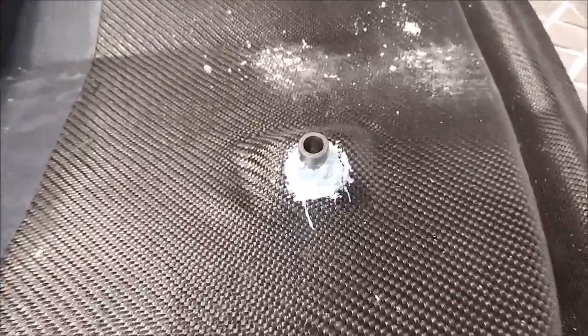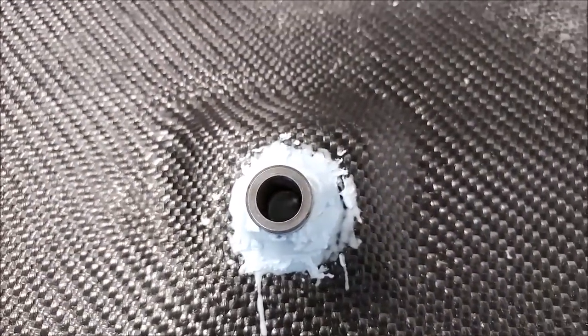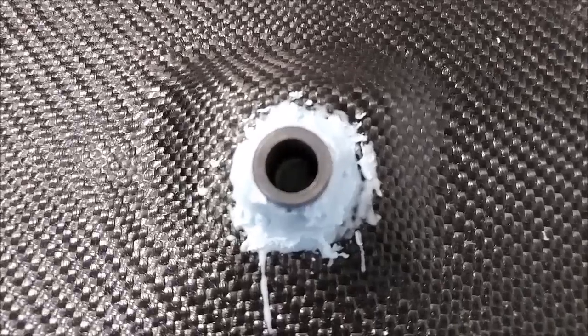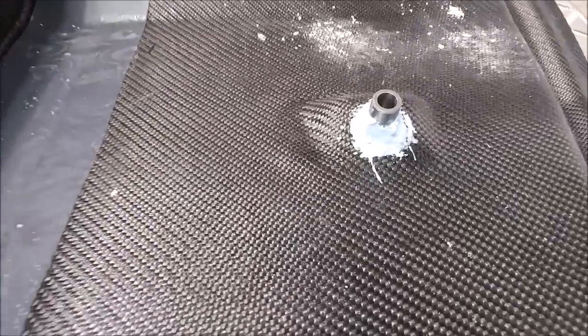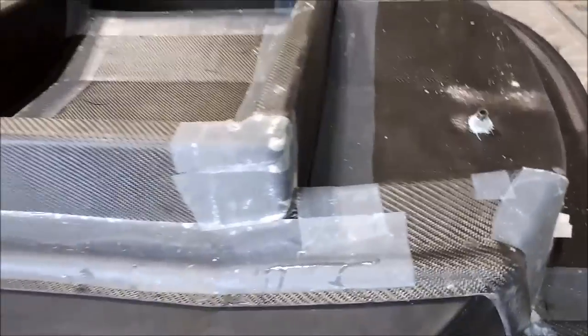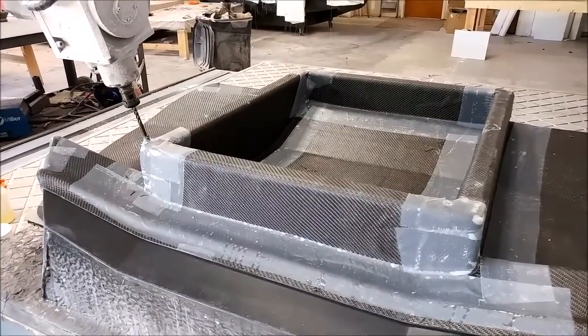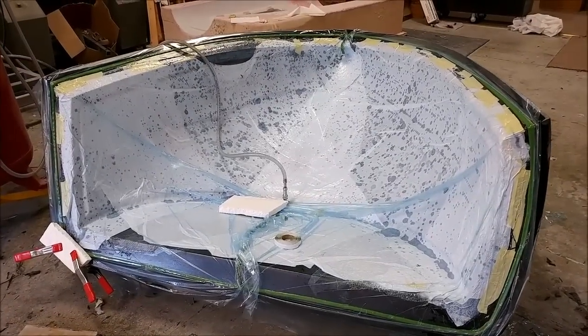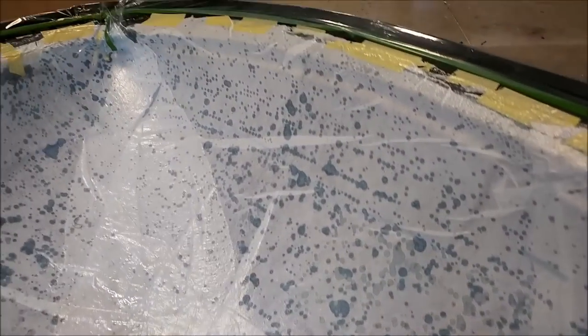While that was going on, I was bonding in drill bushings for the mold for the rear pressure bulkhead. These are for the gear pivot point and also for the upper gear scissor rotational point — four altogether, all half-inch. You may have noticed I had the drill bit in upside down; the reason is that the bushing doesn't move as much when it's on the other end of the drill bit.